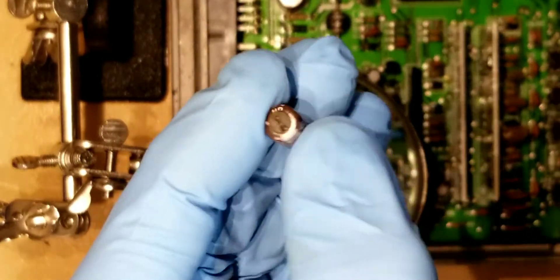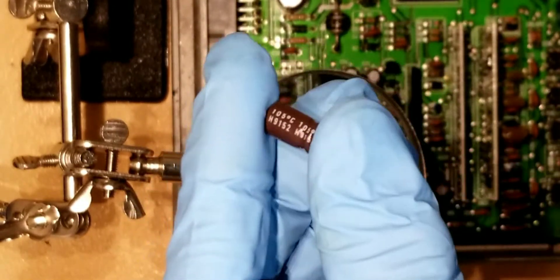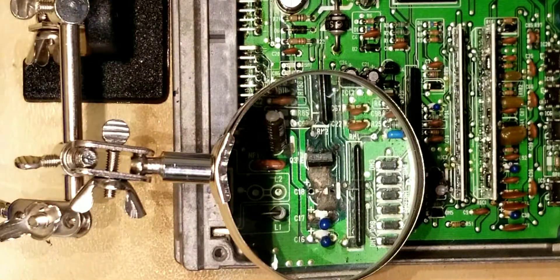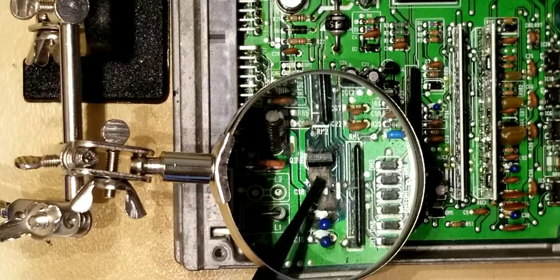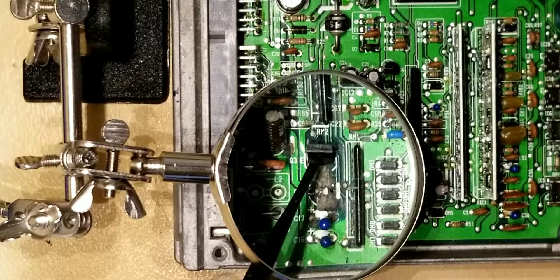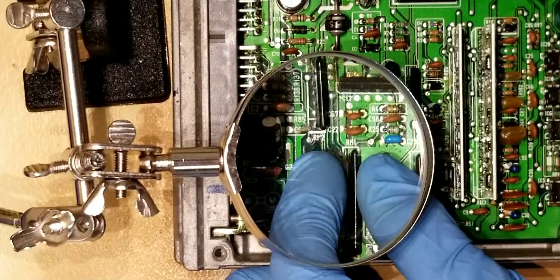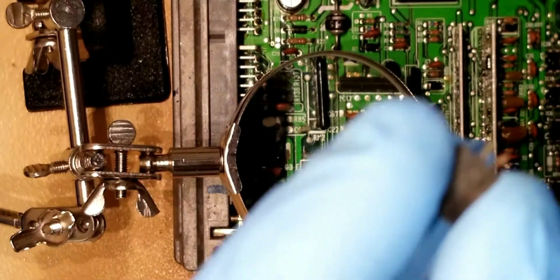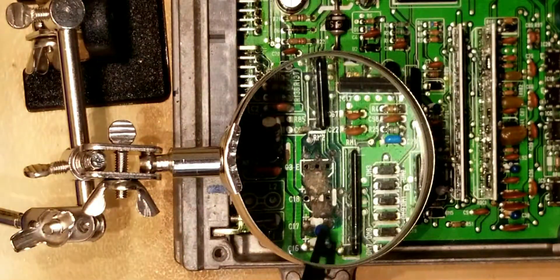It's 10 volts, and it's used for various different parts of the ECU. At 30 years old, these things are getting taxed. Newer models have come out that are higher heat resistance. What happens when one of these leaks is you end up getting corrosion all down on the board. And what happened is it leaked and it made this transistor here either catch fire or come loose. Let me get that closer for you — it ended up burning this one out at the legs and basically caused that part of the board to fry.